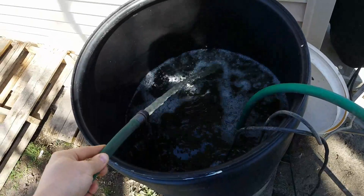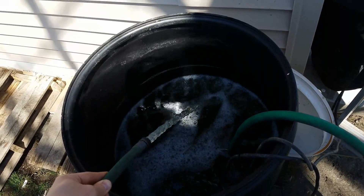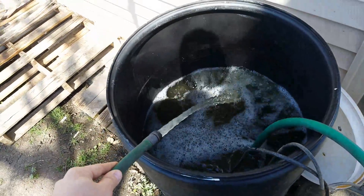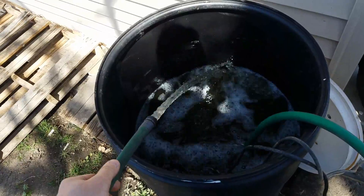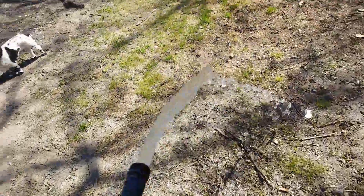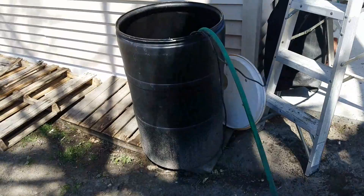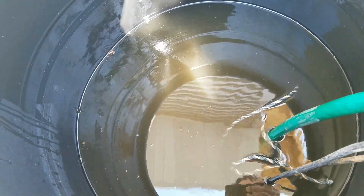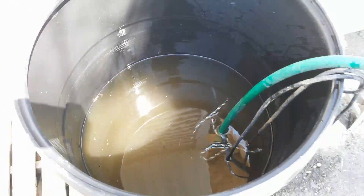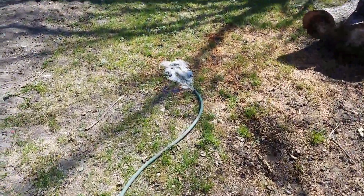A 25-foot half-inch hose at 40 psi flows about 24 gallons a minute, so you could experiment with different sized tanks. A big underground tank would be great — it wouldn't be obtrusive or visible. You could plumb in an irrigation system underground with a garden hose or PVC pipe with sprinkler heads, however you want to do it. It works pretty well — give it a try.